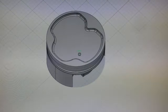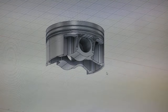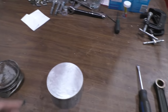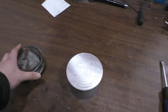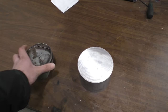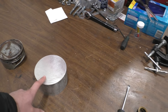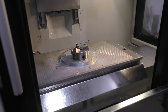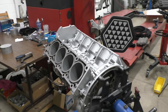Now that the design is done, the next and even more difficult part is actually making this piston. There are a few steps involved — we're going to start by machining the bottom side and you'll see the full process. Now that the piston design and G-code are generated, it's time to put this block of aluminum in the machine. After quite a few steps, we're going to hopefully end up with a piston. This first one is just a prototype, and if the dimensions come out properly, we'll machine the other eight with the same code.